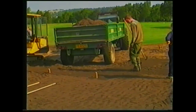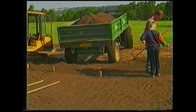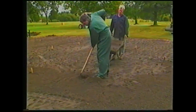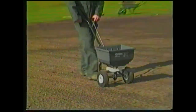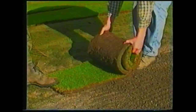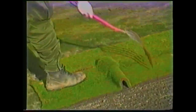Eventually, the required depth of root zone material is achieved. The final levelling, treading and raking of the surface continues until the task is finished to the satisfaction of the head green keeper, and the root zone reaches the green mark on the level stakes. A light application of pre-turfing fertiliser is now made, which is lightly raked into the surface, and the green is ready to accept the turf. The first turf goes down with a warning from the foreman not to tread on the raked surface. The outer edge turves are then relayed.